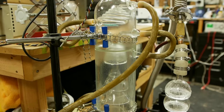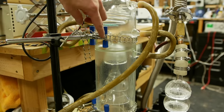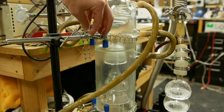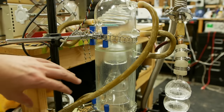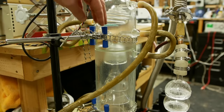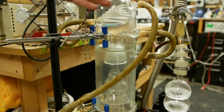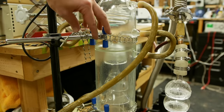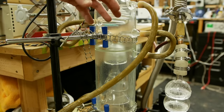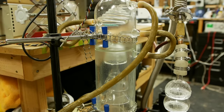Next there's a cold cap — basically an upside-down cup that has cooling water also running through it. The purpose of this is to keep the top of that vapor column cold so that the vapor doesn't become uncontrolled. We've got potentially thousands of watts of hot vapor coming up here, and if we just had a piece of glass at the top it would quickly become as hot as the vapor. So this cold cap is another invention to make sure that the top of the column stays cold and all the jets stay focused downward.